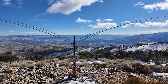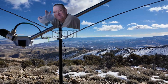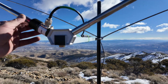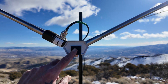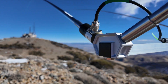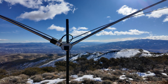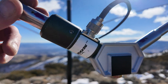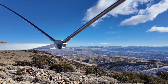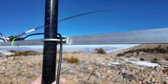Closer look at the Savvy Beam — model RJO, in memory of N7RJO, John Byerly. What it is here is a four-foot boom. I'm loading the driven element with this chameleon blank. Everything is bonded. The whips — these hubs are tapped for three-eighths inch. We might make a different version for M10 too, but it wouldn't be as durable a Yagi as this is. And then on the other side there's just another hub. Everything is bonded with the boom here, and there's our U-clamp for mounting.